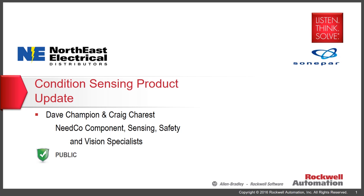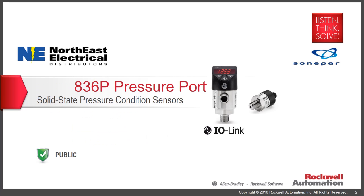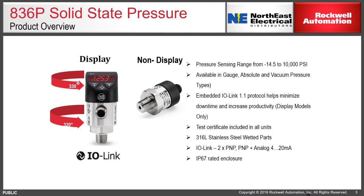In this case, I want to introduce you to a couple of new members that will be replacing, in particular, the pressure and temperature families. The first new members are in the pressure sensing family. They are comprised of a new display version and a new non-display version. In both cases, they are very rugged, IP67 rated. In the case of the display version, one of the newest and most exciting features is the I/O link capability that's been added.